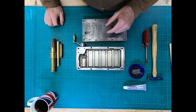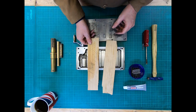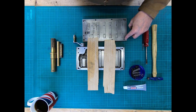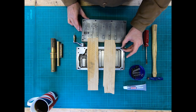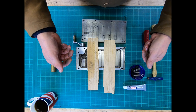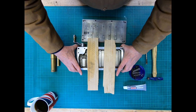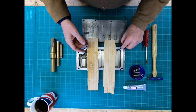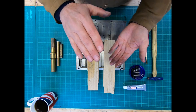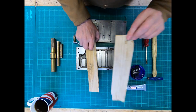The order of operations for putting it back together: I plan to put the wood in again so that allows me to position it, then put the screws up through the bottom because they come up through the bottom and screw into the top. I'll put something underneath to lift this up slightly, put the screws in so they're only protruding a very small amount - that will help me hold this off the magnetic part, because once it's on there it doesn't want to move - and then put the dowel pins in from the top.